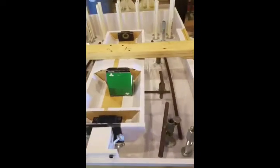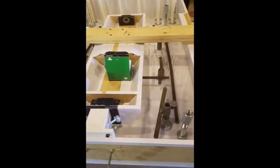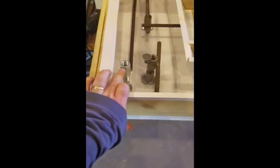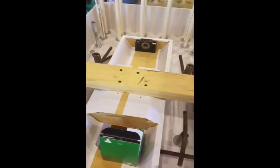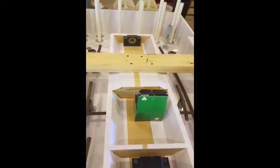Aside from that, it's actually pretty easy. These studs — these are coupler nuts — will not spin in the epoxy once they're embedded. I put washers on the bottoms of them just to help reinforce them so they have a little more pullout strength. Do some research on polymer concrete and you'll find it's some really durable material and actually pretty easy to work with. So hopefully you guys pick some things up. If you've got questions, I'll try to answer them.